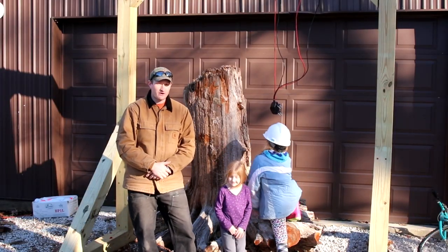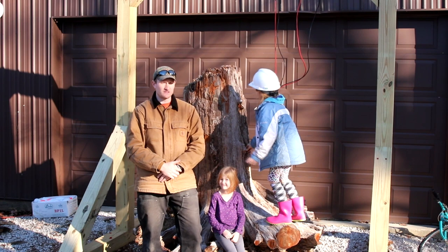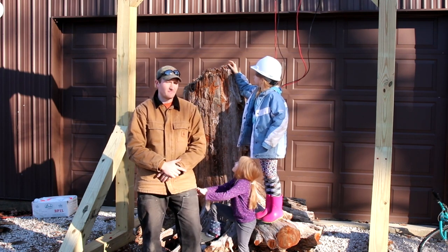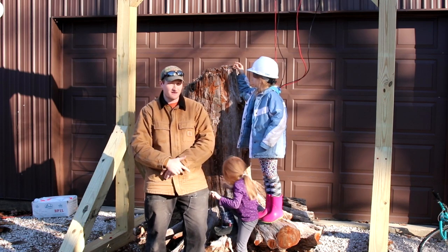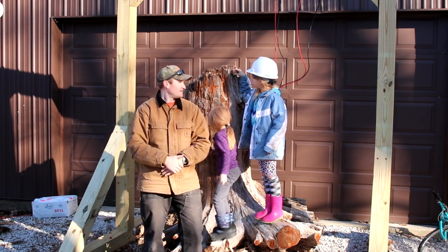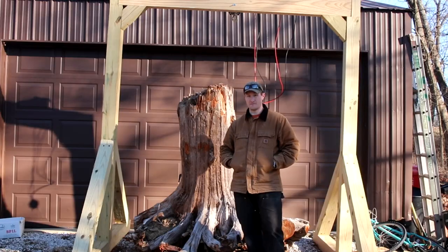As you can see, the gantry crane worked pretty well. There are a couple of alterations I'll probably make in the future — I'll probably eventually go up to just a normal two-ton chain hoist, but I used the winch because I can get maximum height out of the gantry. It held the weight no problem. The hardest part was actually getting the trailer in between the legs because the beam I used is only exactly as wide as my trailer, so if I don't back up perfectly I end up having all kinds of problems.